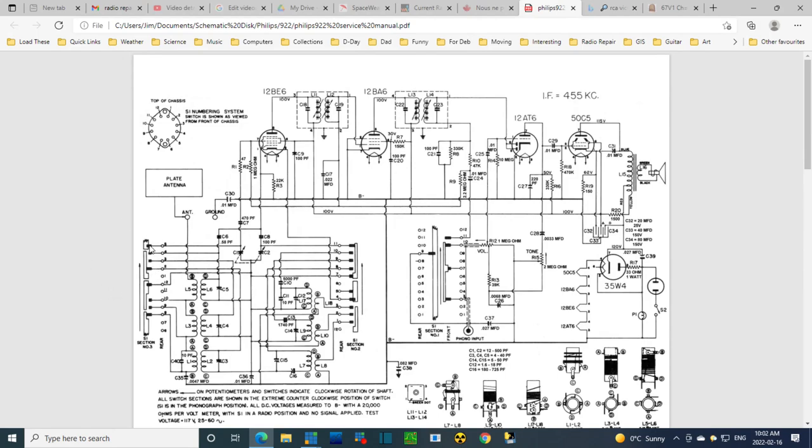So we can look though and just say, well, where are they actually putting it? So through this capacitor, as I said, right onto the grid. Why can't I just go right on the grid? Put my capacitor here, go right on the grid. Or even go on the other side of this 47 ohm resistor. So you see a low value resistor in a grid circuit. It's often there to prevent some kind of oscillation, I believe. There's the mega ohm here.